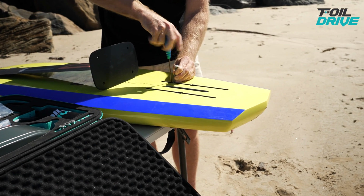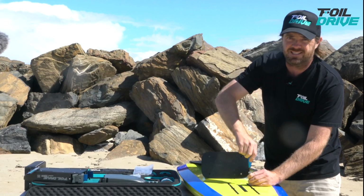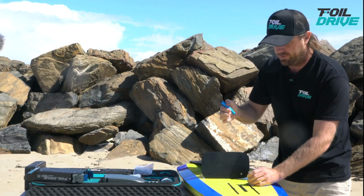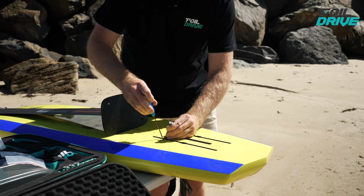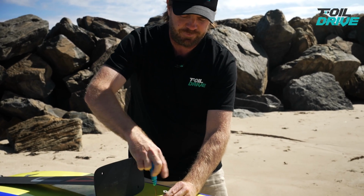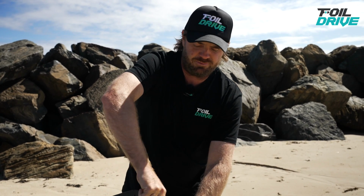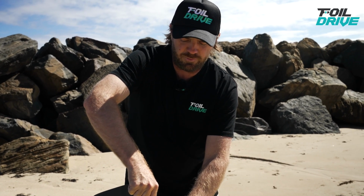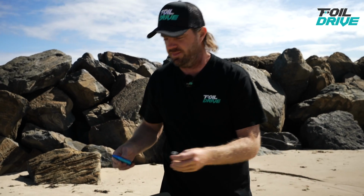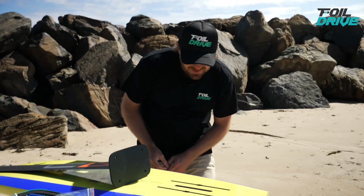These 20mm M3 screws, you don't need to do them up super tight, they just sort of nip up a little bit. And what that does is it prevents the T-nut from being able to slide backwards and forwards, and then you end up with perfect alignment for your bolts later on. All right. That's actually probably one of the trickiest, most time-consuming parts of the entire thing. So, got my T-nuts in place.